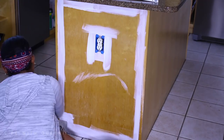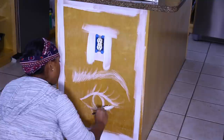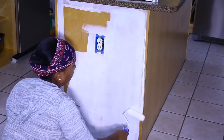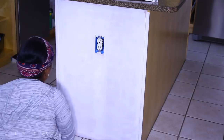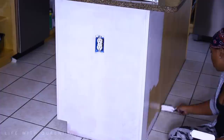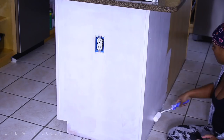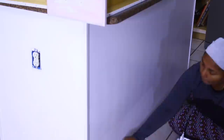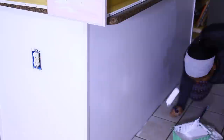Now I'm working on the kitchen island. I cleaned it off, got a little bored, and drew an eyeball on it — painting cabinets and islands can get boring, but do whatever makes the time pass. I'm doing one coat of the Zinsser primer — no sanding required. Make sure you clean everything, get the grease off. I used a mixture of Dawn soap and the Awesome cleaning solution in very hot water. I also did a fingernail scratch test after priming to make sure it didn't peel.